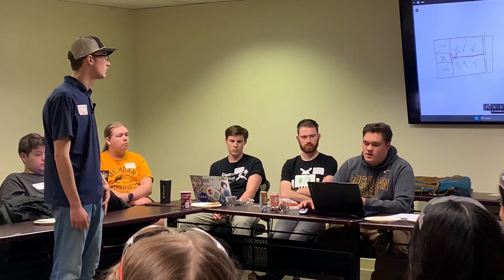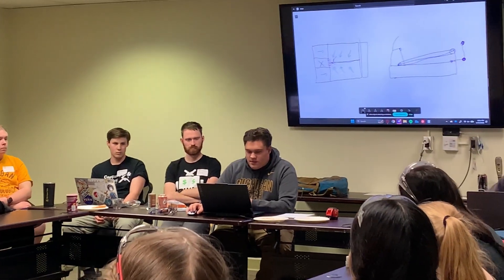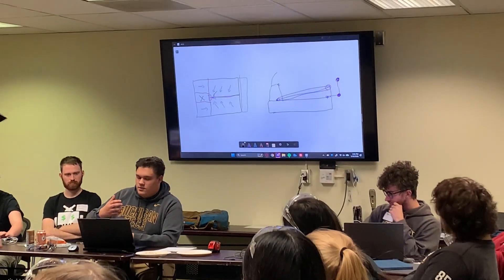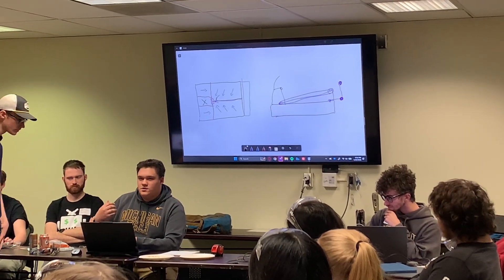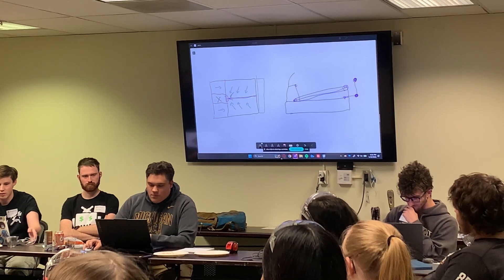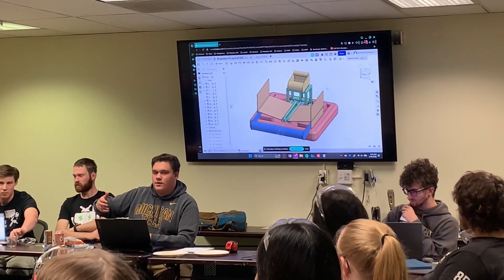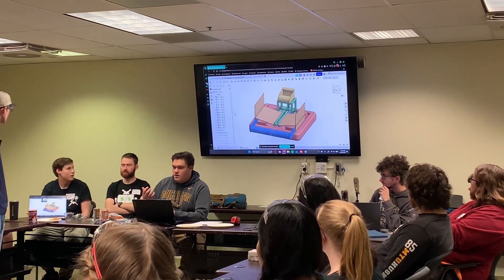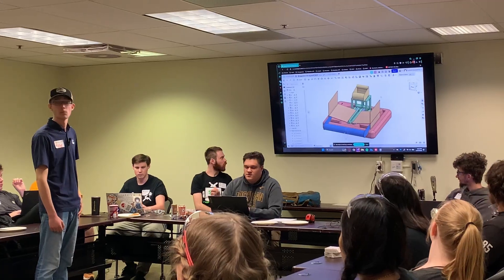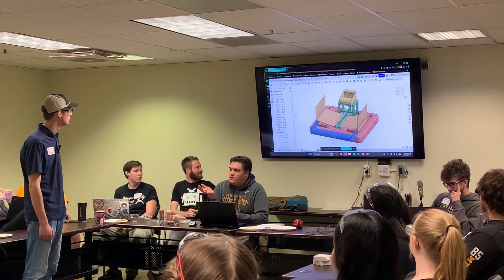As of this year, you can carry a limited number of balls. When the balls come into the robot, they will be funneled into a V-shaped funnel. There will be two belts at the bottom to help intake the balls into the back end of the robot where the shooter is located. At the back end of the robot, there are going to be some belts or a kicker wheel to suck the ball into our ball tunnel, and then it will go into a fixed hood. With some simple calculations, we've figured that it will be a 22-degree hood angle, so we'll keep that stationary.